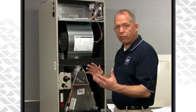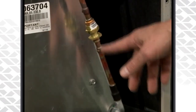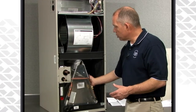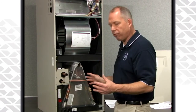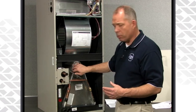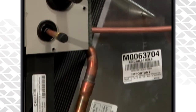Just a brief description of the refrigerant flow: refrigerant enters on the liquid line, passes through the metering device — either a piston or a TXV — and enters the right-hand side of the coil. Once it enters, the liquid starts to boil off. Micro-channel coils are a single-pass coil, not a multiple-pass, multiple-distribution coil like our fin and tube coils. The refrigerant absorbs the heat out of the air, and the cool vapor exits the coil on the suction line and goes back out to the condensing unit.